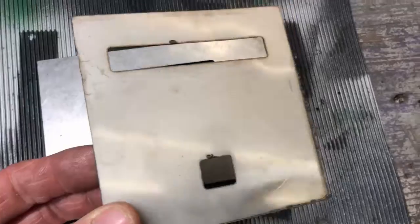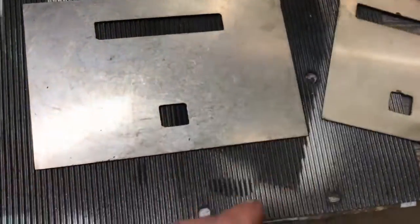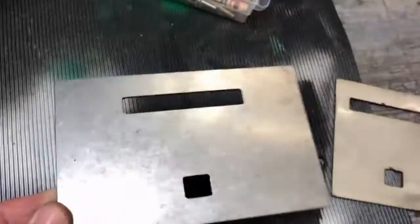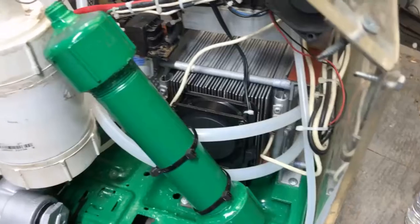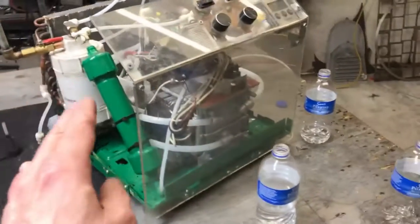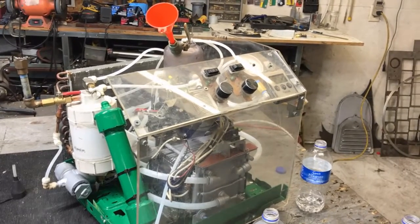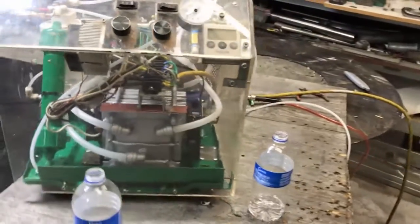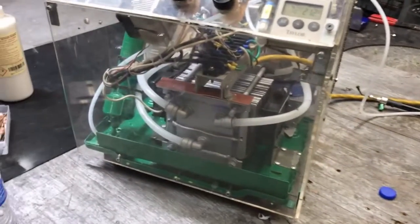You can see the gaskets there — so that's the actual cell area, and this is what the plates look like now with a completely different flow configuration. To make up for the metal I lost cutting these new plates out, I added two additional plates, so my volts-per-plate-gap is going to be a bit different. I'm hoping I don't lose too much performance, because this is not about efficiency when you're building a torch — that'd be like trying to make a dragster efficient. You want to make it as inefficient and as powerful as possible; high power is the goal.